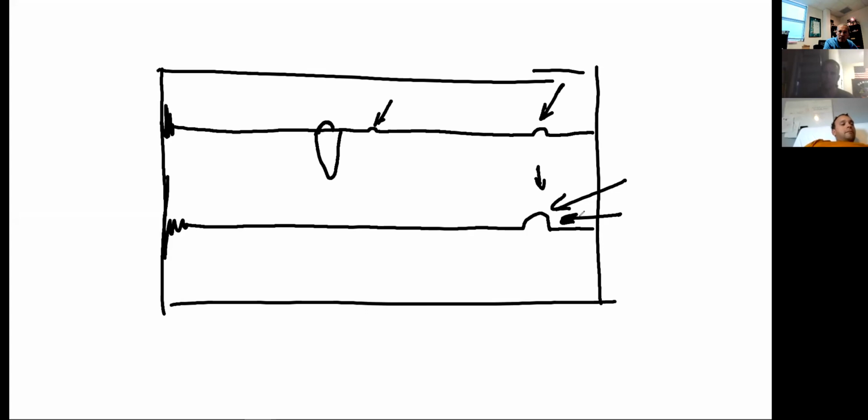Move the machine and take a new measurement. No, you leave it right where you're at. Remember, this is a phase to ground fault in radar mode. But I want to verify my end. What can I do to it to make this thing go from up to down in radar mode, not thump mode? Ground it. Ground it.